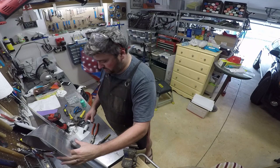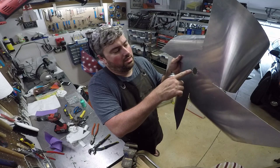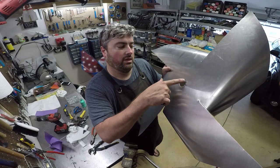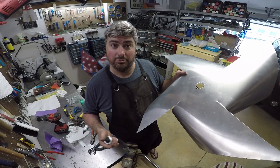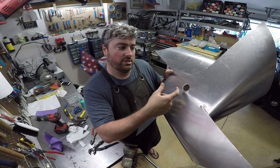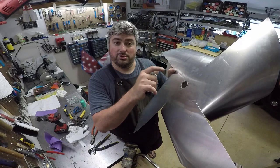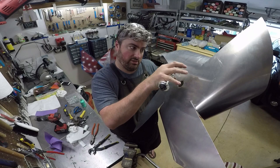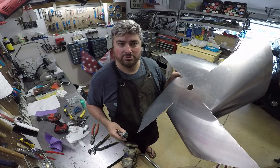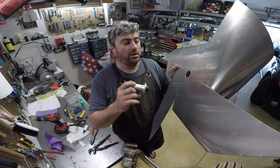Now we can just start riveting this up. But if this is going to be outside for a long period of time, the weather and the wind and the gusts are really going to wear on these little holes — it might not be enough to hold this thing together. On the big pinwheels, what I did was add an extra large thick plate of aluminum right here to stabilize and reinforce the middle part, then drilled the holes further through, used bigger rivets, and riveted that plate in key spots. I also used a little bit of epoxy between the aluminum pieces and the hub. For this one, I'm not going to bother adding an extra plate since it's a much smaller pinwheel, but I am going to add a little epoxy — we're going to use some JB Weld.